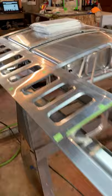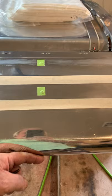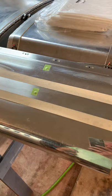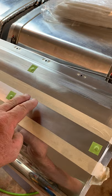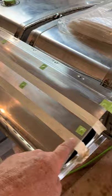Do it the way the factory is doing it now. You come down on your wing to the second row of rivets on the leading edge skin, come to the second rivet, and mark your spot three-quarters of an inch on either side - so you've got an inch and a half right there. Then scuff this area because that's where we're going to glue the fabric. The top fabric starts here and goes over first, then the bottom fabric wraps over on top of it.